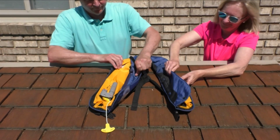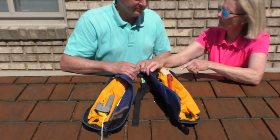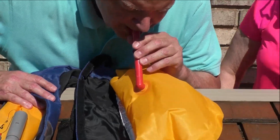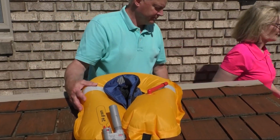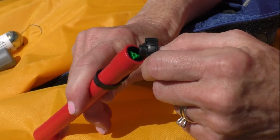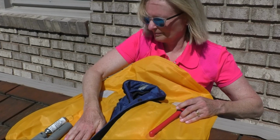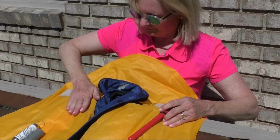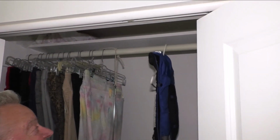Should inflatable life jackets be inspected or tested? Yes, inflatables should be visually inspected each time before they are donned to ensure that they are properly armed. At least bi-monthly, fill the chamber with dry air and leave it inflated overnight at a constant temperature to check for loss of pressure. Deflate by turning the cap upside down and pressing its top to open the one-way valve. Gently squeeze or use a shop vac to expel the air, being careful not to wring or twist the life jacket. Then, repack it properly. Store in a cool, dry place.